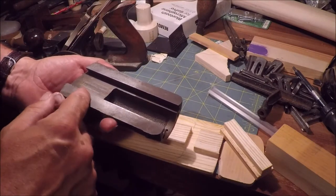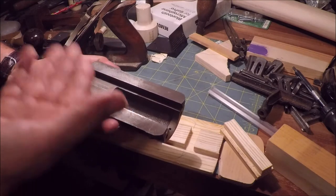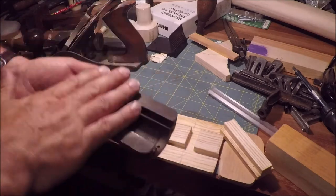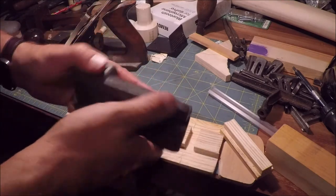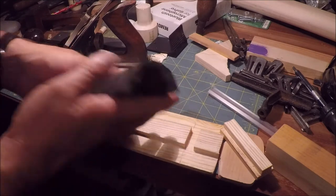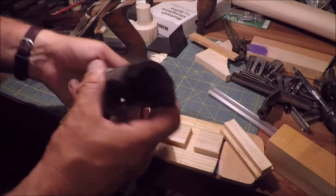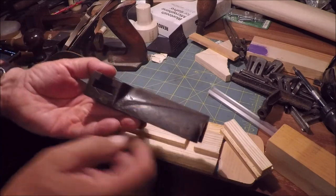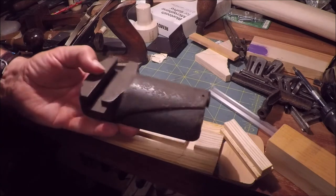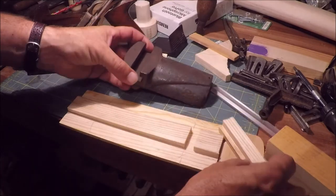Whenever we do these kinds of projects, all the machine surfaces have to get built out - it's called a machining allowance. You're allowing extra material to machine off. So we have to do the bottom, the T-slot, the top of the T-slot spot, and along the back - those are all machine surfaces. In addition to that, we're going to fill up this big T-slot.